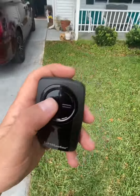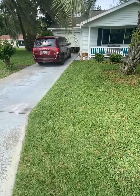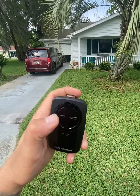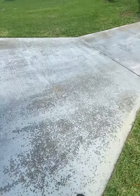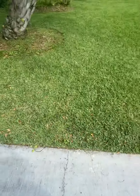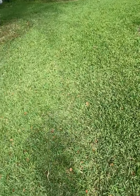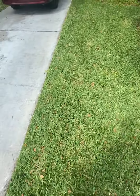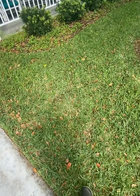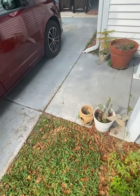Watch this, guys — remember, look at that. Stop it, come down. Okay, so the refrigerator that they just installed a couple weeks ago — Samsung — is creating interference with the motor and the remote. I changed the logic board and that didn't fix it. Once I realized there were no LED bulbs in the motor or ceiling, nothing else around, I asked them had they installed anything recently in the garage. Obviously the big new refrigerator standing there — they said yes, they put the new refrigerator in.